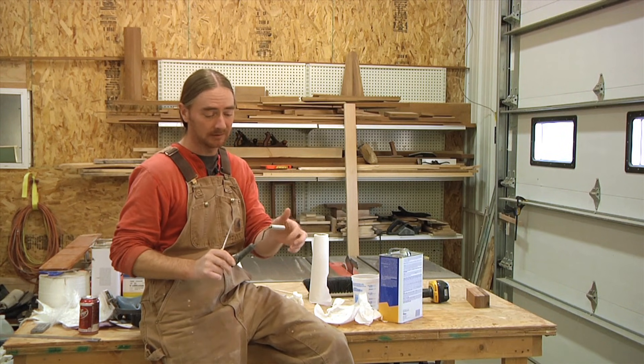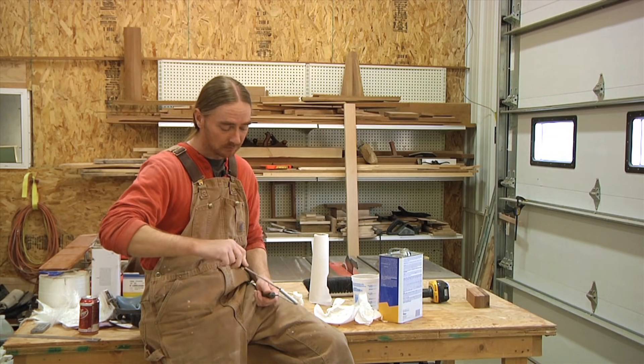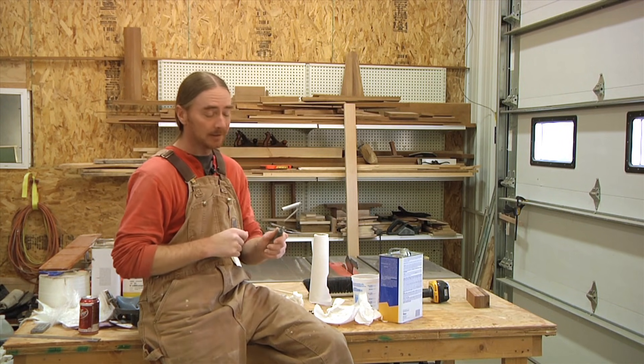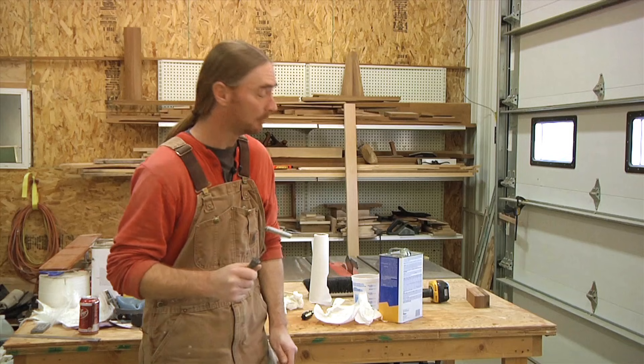This frame, at least this one, is made out of aluminum. If you over-tighten it, you're just going to strip the threads. So snug, but not tight. And that's it — now it's clean, ready to go, and it will not cause you any problems the next time you need it.